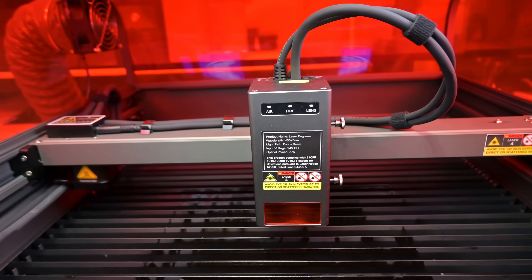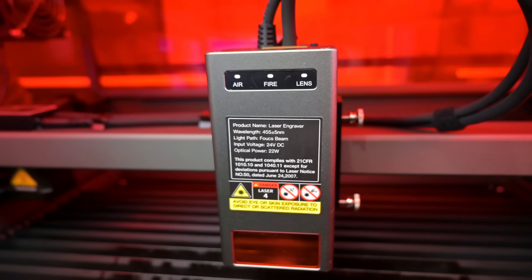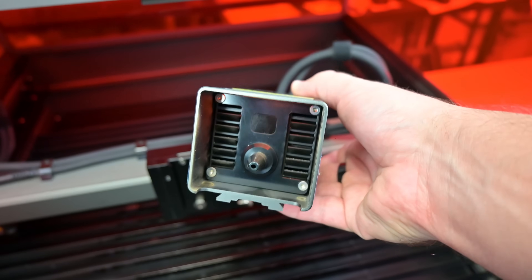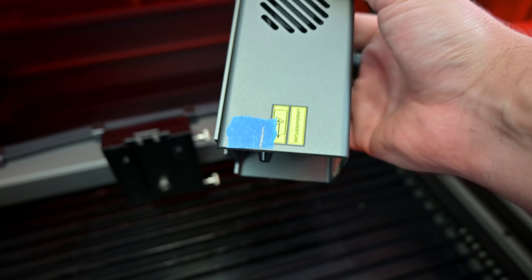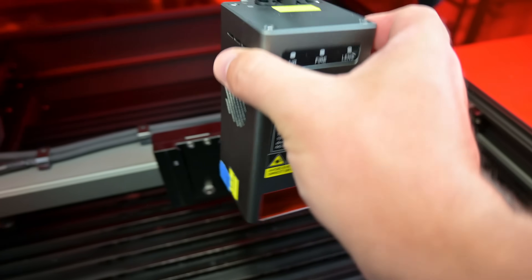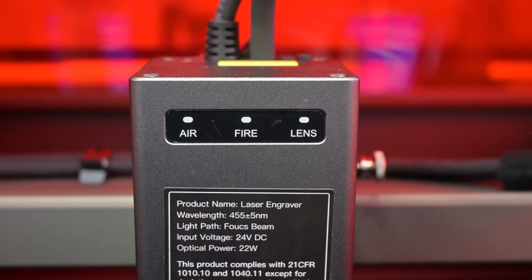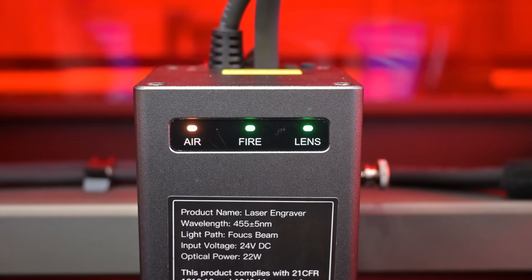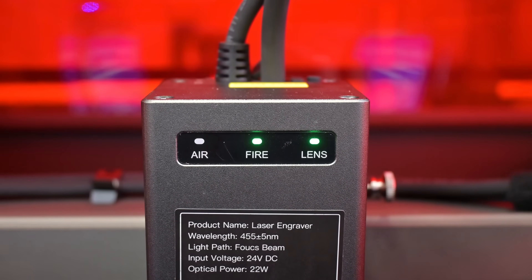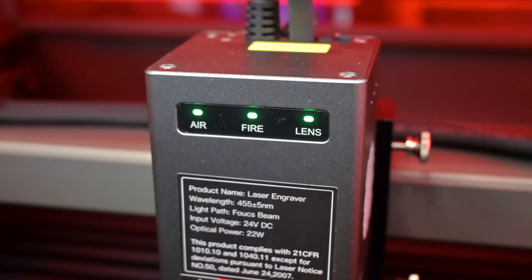Starting with the laser module, we see the dual cooling fans on the side, which cool the diode lasers and help clear away the smoke. Helping with that is the air assist compressor, whose hose connects to the top of the laser module and pumps air out of the nozzle at the bottom. The nozzle is offset towards the back rather than centered, which makes manual positioning a bit tougher. I ended up drawing lines on the side of the module to indicate nozzle position to help with that. The front has a transparent plastic shield that blocks much of the laser light while still giving enough visibility. At the top of the laser module are three alarm lights: the air light turns green when air assist is at max speed, yellow if the air is flowing but not fast enough — indicating the compressor filter might need changing — and red when the compressor is not running. The fire light turns red and sounds an alarm if it detects fire. And the lens alarm triggers if it detects that the lens is dirty, giving you a heads up to clean the lens before it gets damaged.